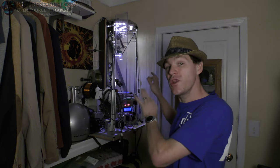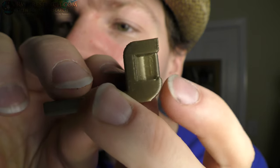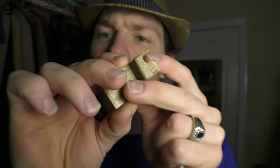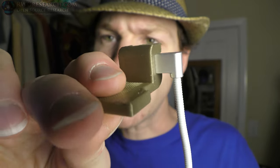There are several factors here: experience with 3D printing, knowing the tolerances you need, understanding how 3D printing works — like adding support in the right place — and knowing how to tune the printer and understand how it's going to function when it's all said and done. This is PLA. I use 0.15 of a millimeter as my basic tolerance and it's almost perfect every time, unless you have something funky with your printer like too much extrusion. The first thing I want to do is just see if this fits.